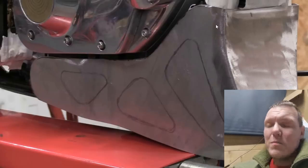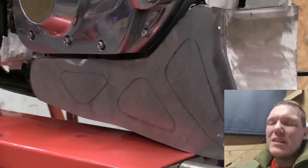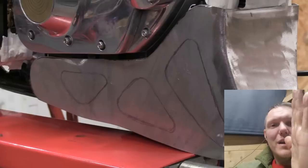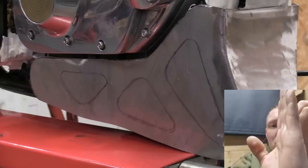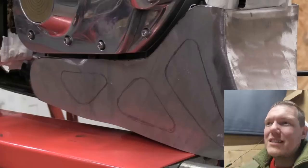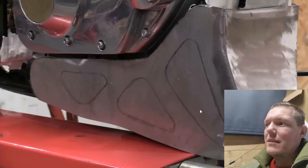And then I make this 22 width with my stupid dowels and my pen idea. Two dowels sticking out, or rods or bolts, whatever, anything that's going to track the surface nicely, and then your pen sticking out. And I'd make that distance between the edges of the dowels, so you've got a circular dowel there where it's just tangential to it, and then your pen sits where the crosshairs of that are, if you get what I mean. And then you just mark there, and you do this off the bench. You don't need to have it on the bike.